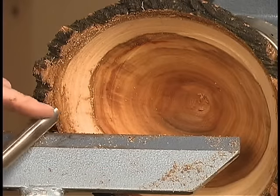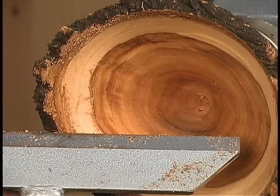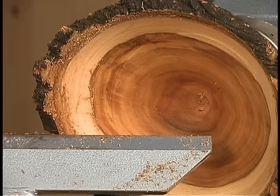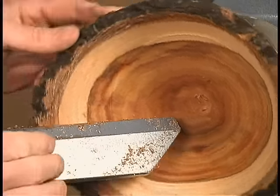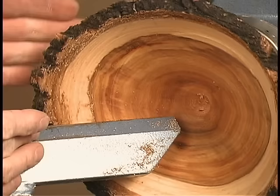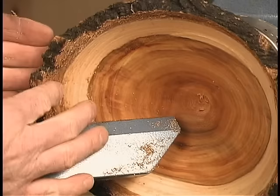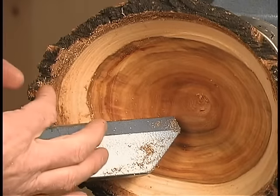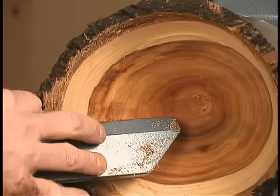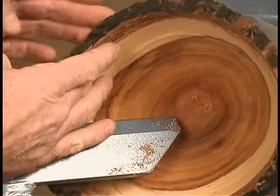Okay, just went to the grinder. Got a good, fresh, clean, sharp tool. Now I'll go in for our final wall thicknesses. I'm going to bring our tool rest in. Basically, trying to match the exterior curve on the interior here. It'll really become glaring if we miss our wall thicknesses here, because this high elevation here will have to look like the lower elevation here. So we're trying to make those look fairly consistent.